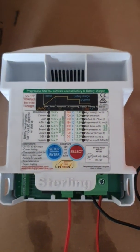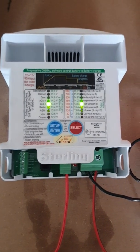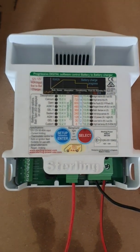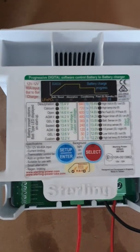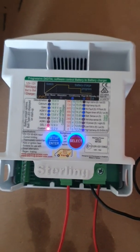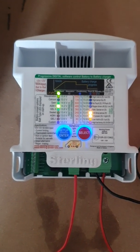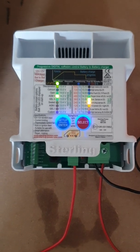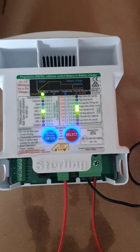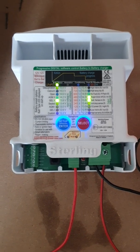You'll know when you're done because the green LEDs will just be flashing. Wait a couple of seconds and the unit will reboot with your custom charge voltage applied. The custom LED will turn on to confirm this. This is all in the instruction manual if I've gone a bit too quickly, but it is relatively simple and logical — all three stages of the battery charger are adjusted this way, and then you can adjust the time factors after that.